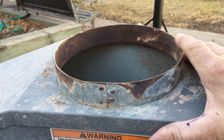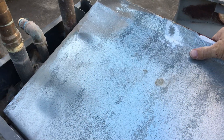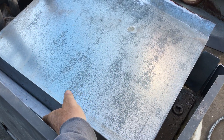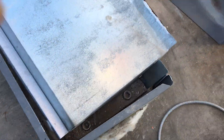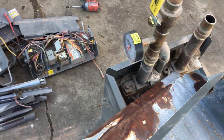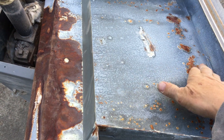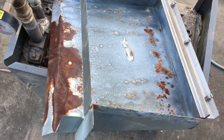You can see this one is well on its way to corrosion. So that's the draft hood. This I call it the smoke hood — it's just the cover for the top of the heat exchanger. Looking at the underside, you see the typical corrosion of a copper boiler. It's pretty rusty, really starting to attack that galvanized steel.